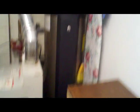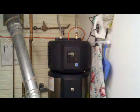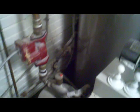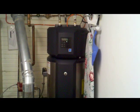I did level the hot water heater — it definitely wasn't level as-is, so I took care of that. I also added my condensate drain and ran it outside. If it freezes up this winter, I'm going to put a condensate pump in there and have it pump over to my drain. Not worried about that right now — just want to test it, see how well it works, and go from there. Let me know what you think.